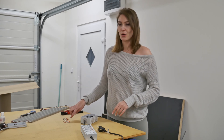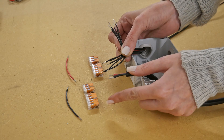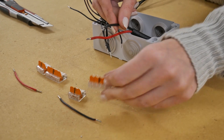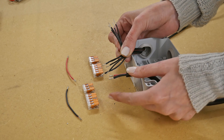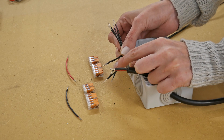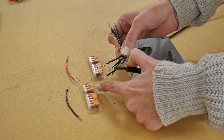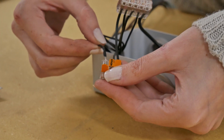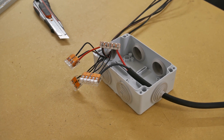We prepared the electrical box. Now we are going to use the WAGO connectors to connect the light source together with the light bars. You can see the five-pin and three-pin WAGO connectors. We are going to prepare both of them for plus and minus. We take the minus from the source and plug it into the first one, then use three pins for three of the minus cables. The last pin we use to interconnect it with the next three-pin connector, and the last two pins for the remaining two cables.